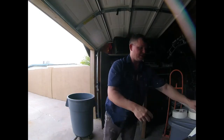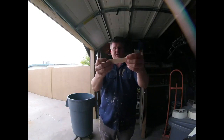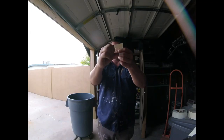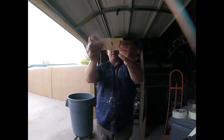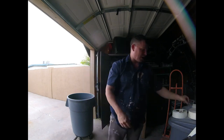There's a lot of different ways. If I'm not able to get the pipe actually in the hole, I can do another technique like this. I could take my tear tape, just cut a piece, and then cut my hole for my pipe, and then I could just go around it. Well, I can't get the pipe in there because there's an angle stop or something big. So another technique is you could tear it in half like this, and then join it together around the pipe, make a nice tight fit wherever you want. So there's a lot of advantages with paper tape versus fiberglass.